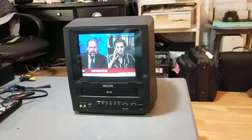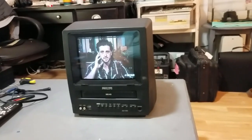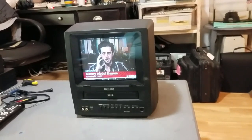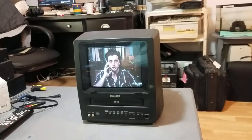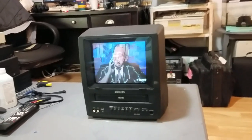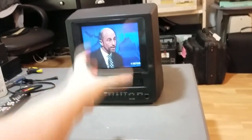I had a bit of a scare. Once I got this thing back together, I found that rewind and fast forward was working fine, and ejecting the tape was working fine now. But I found that now when I played a tape, it wouldn't sync to the proper speed — it was just playing the tape way too fast. And I noticed that while the tape was playing, the tape counter was not advancing. And I'm like, oh crap, I've lost the control head. The circuitry's not getting any signal from the control head. And I knew right there that a connector didn't seat back on the PCB properly when I installed the VCR mechanism.